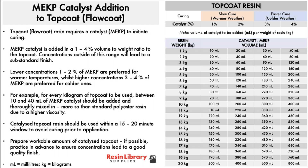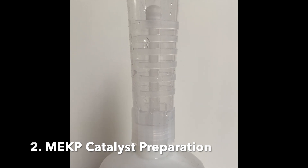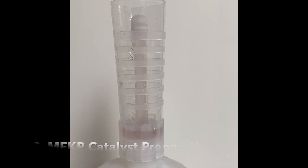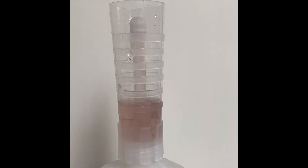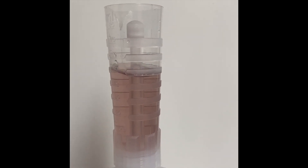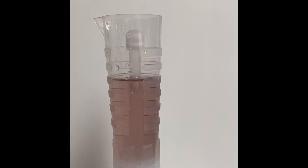The table on the right shows a range of increasing quantities of top coat resin to be used, with corresponding catalyst volumes to be added to achieve set concentrations. When preparing the catalyst, it's important to accurately measure out the quantity required. Most roofing kits will come with a catalyst dispenser. As you can see, the liquid is filled into the container like this, and it allows it to be measured with the measuring gauge on the side.